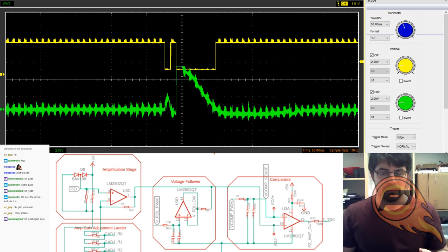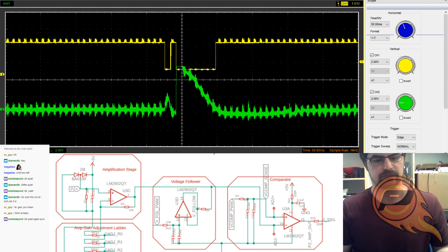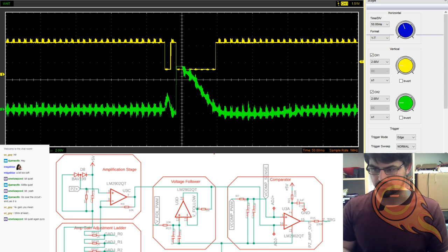So it's an active low sensor when it's acting like this, which is good for safety. I used to have it on active high, but fixed that. But either way, the V2 on this one should allow us to make profiles based on what kind of piezo disc you're using, what kind of printer you've got, what kind of mechatronics or kinematics you're using, how you've got your thing set up.